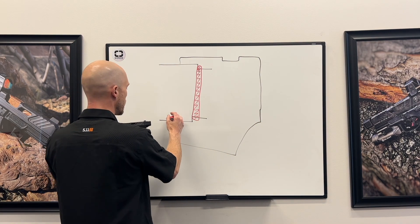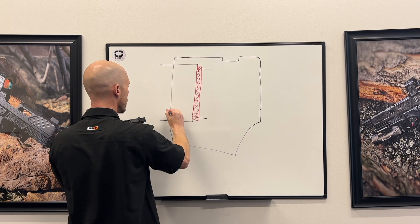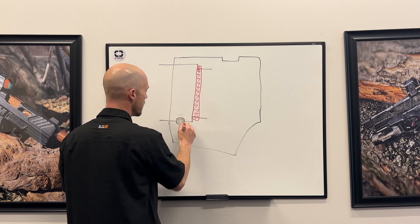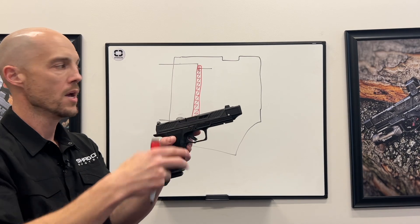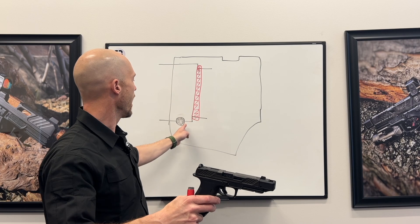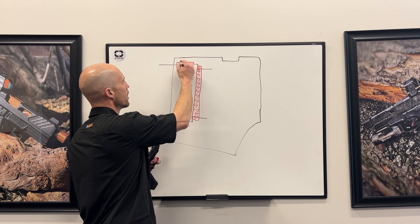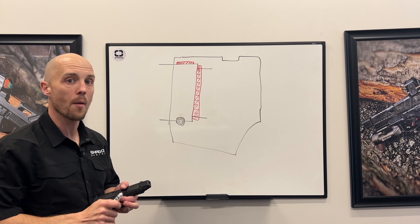At that location there is a locking pin. The locking pin goes halfway through the barrel and then through the side of the compensator, and it's removed from right there. So imagine this whole assembly is under compression because of the O-ring, and the pin is locking it in place. Up at the top, underneath the front sight, there is a locking key that is in both the barrel and the compensator, and it prevents the compensator from twisting.